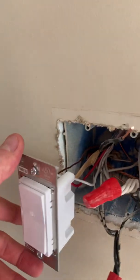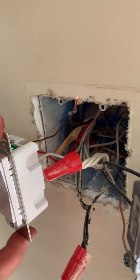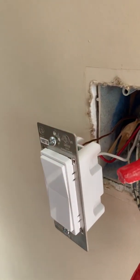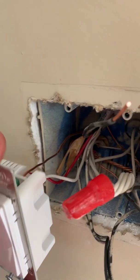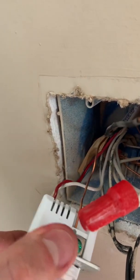The three-ways I had in here before didn't operate like that, I guess because of the neutral wire. I don't need this black one, so I'm just going to cap that — it's not hot or anything, but I'll cap it so it doesn't poke anything else. And then I've got the other black wire sticking out over there. For this switch, I just used the red and the white wire — again, the traveler and the neutral.